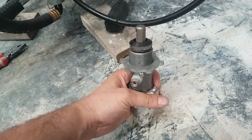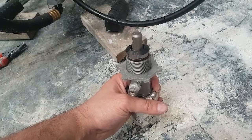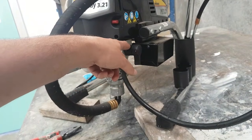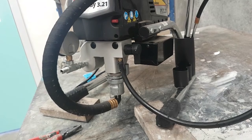Other than that, there really is not much else that goes wrong. Other things that can go wrong are different — if people request that I explain other things such as what's causing the prime spray valve to not lock in place, sometimes you'll hear your machine hissing out of there, and that just basically means it's normal wear and tear on the inside, or you've got something stuck behind the needle and seat. But we'll address that in another video. Hopefully this video answers a lot of your questions and makes it clear as to what's happening, and how to remedy it without sending it to a shop and waiting sometimes up to three weeks. I'm Ali from West Spray Airless — please feel free to go ahead and ask in the comments section. Thank you very much.